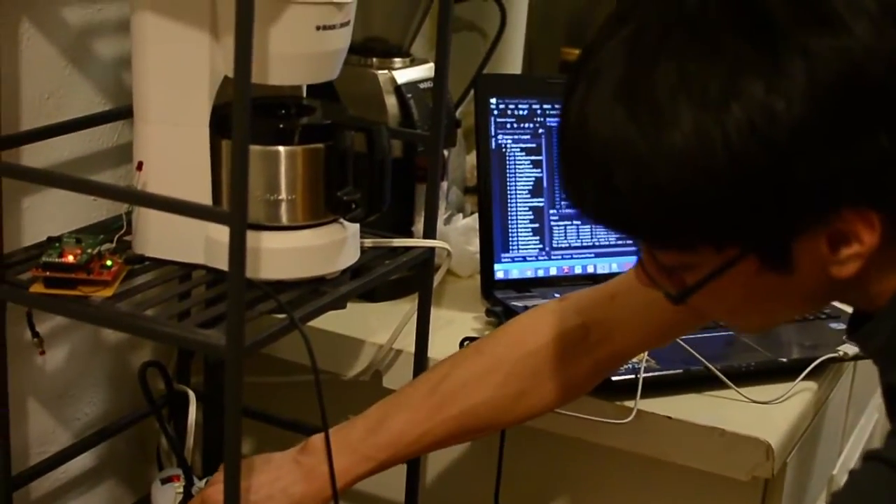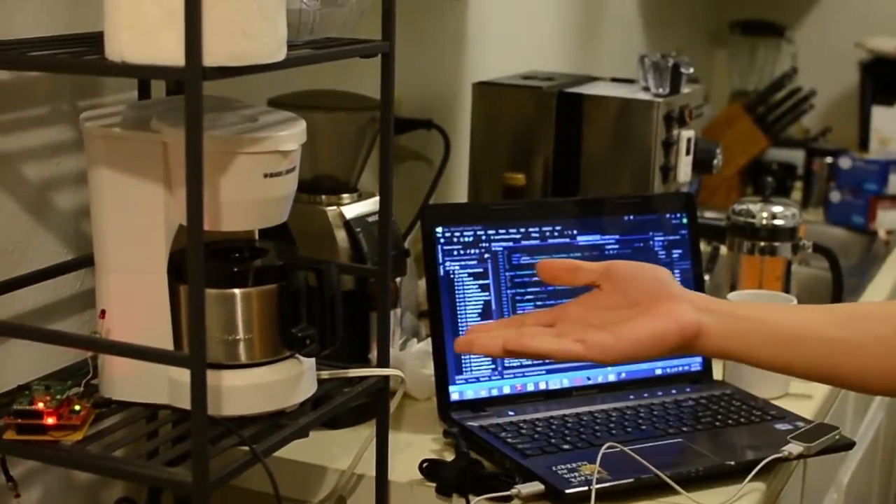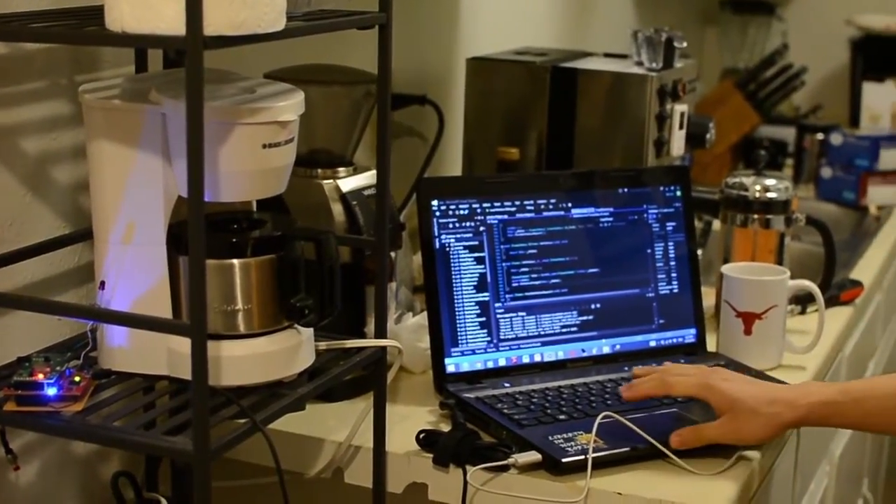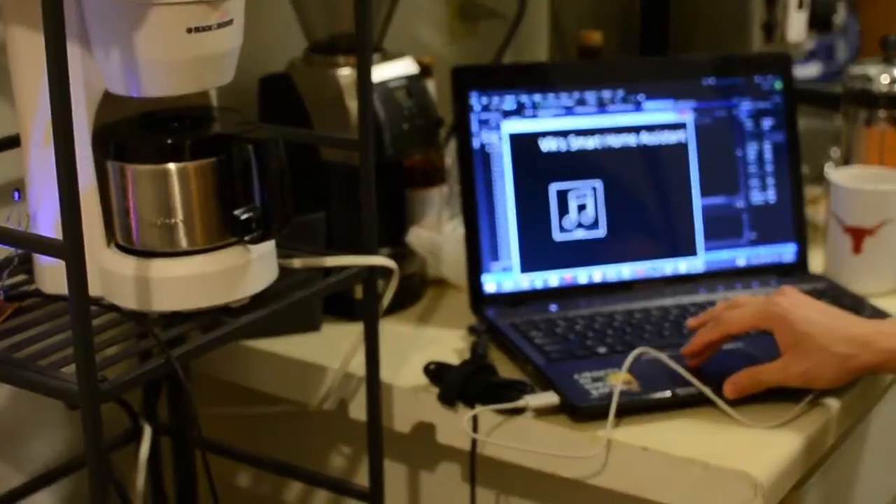Now I will pass it on to Peter, who will talk about some of the communications behind the Wi-Fi protocol that we've used. The Smart Home Assistant uses both TCP and UDP to send messages from the control station to the appliance station, which responds back with messages to tell the control station what happened. We use these features to allow plug and play, where an appliance station can be installed by simply plugging it into the wall outlet, powering on, and initializing its sockets, and then the control station can be started up.